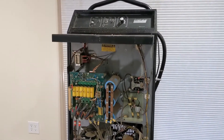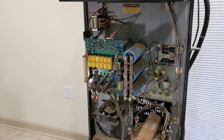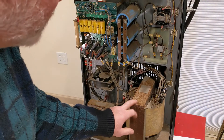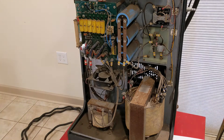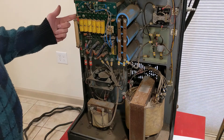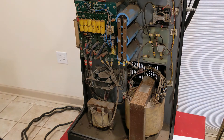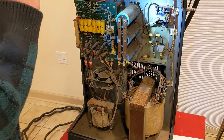Moving in so you can get a closer look. There's a huge transformer here and another smaller one. Here's the fan — I'll probably roll this outside and blow all the dust out. It's got capacitors and resistors. I see a thermal switch. A lot of times these electrolytics will go bad — they only last maybe 20 years at the most. So it's possible these caps are bad; that would be my first suspicion.